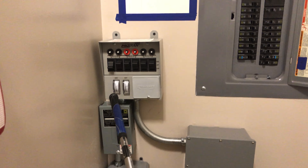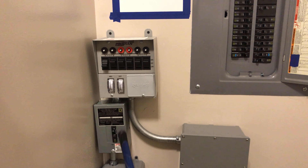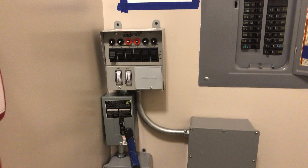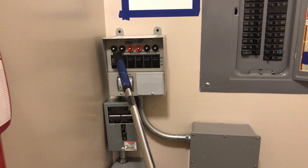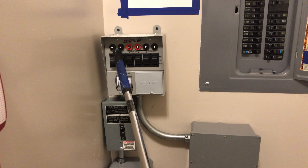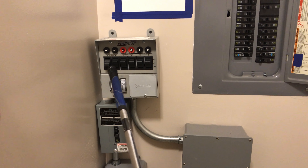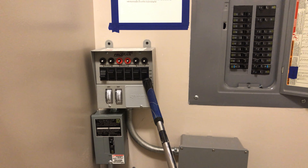Once we come out of this box it feeds all these switches, protected by this breaker to make sure we're not pulling more than 30 amps across all these circuits. Each one of these also has its own individual breaker — the red ones are 20-amp, the black ones are 15-amp. I currently have six different circuits in my house interrupted.